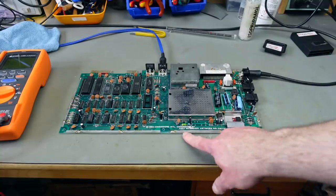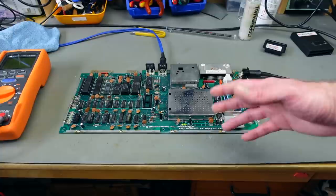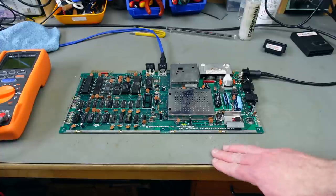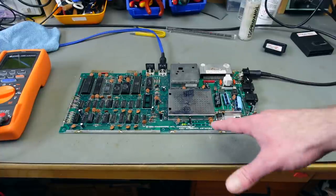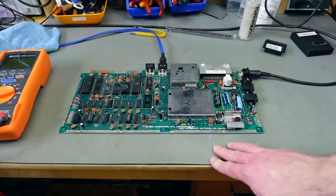As I'm upset, I'm always looking forward to repairing C64s - that always soothes my nerves. I'm going to try to do another C64 repair video. We're looking at this Commodore 64 assembly number 250407 board that got donated by Marek from the Czech Republic - thank you so much. He only needed the SID chip and the case, so it's only a bare board. It does kind of power up but shows a scrambled garbage character screen.